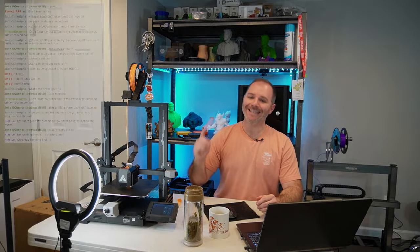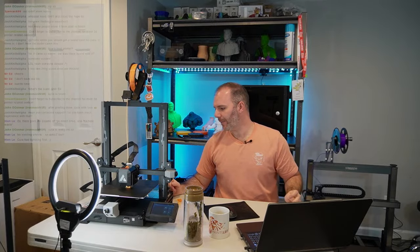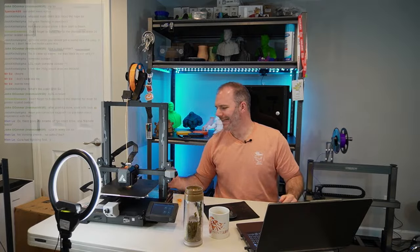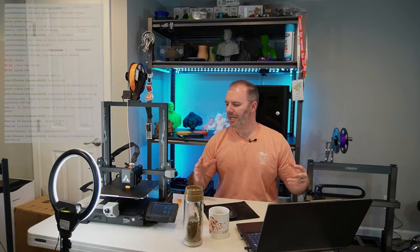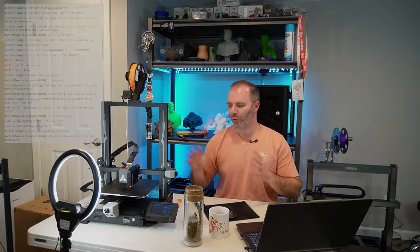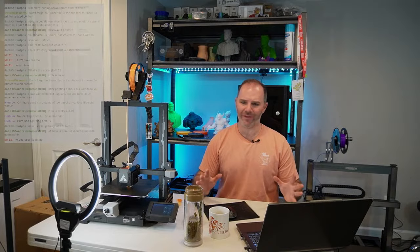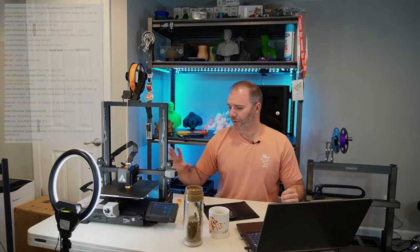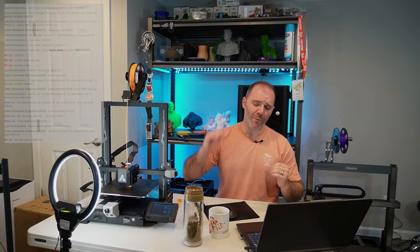No leveling wheels. It does have what I assume is an inductive probe. It's one like I've never seen before. It's not a pin probe, so it's gotta be inductive, or proximity rather. Their profile, right out of the box, had no bed mesh operations whatsoever. So their Cura reskin, their start G-code, just G28 and then lines of G-code. No G29, no M420 S1, so we were never gonna be using that bed probe. So, JG Maker, you gotta fix that. No bed leveling wheels. So we just get it what it is. I think the variance I looked at real quick was around 0.3 millimeters between lowest probe point and highest probe.